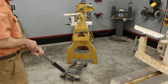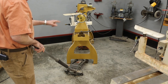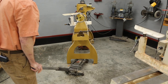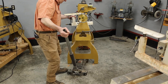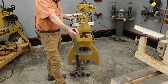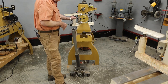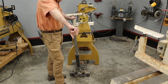Another great way to move machinery — and lathes in particular — is with floor jacks. I move these Powermatics around all the time because sometimes I bolt both of them together so I can turn 11 foot 6 inches between centers for big spindle jobs. I can bring them just a little bit off the floor and move a machine pretty easily with two floor jacks. It's a matter of thinking it through — never brute-lifting anything. You slide it, put it on dollies, use jacks, ropes, levers. You have to think like Archimedes. It's fairly easy to move machinery, but you have to think it through and do it safely.